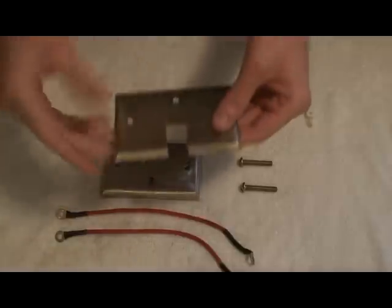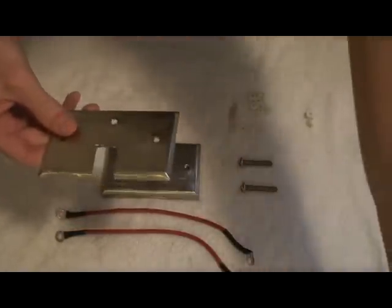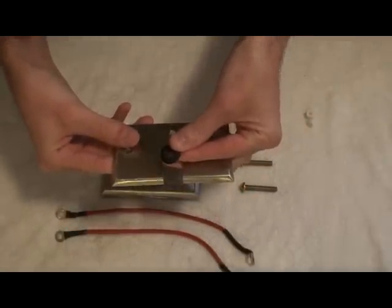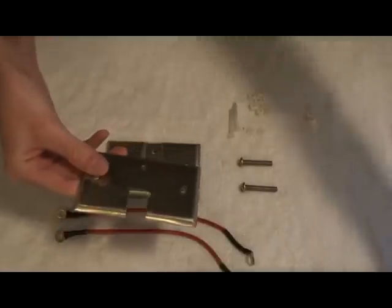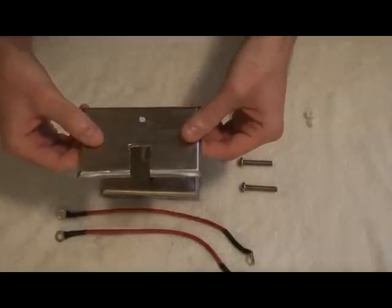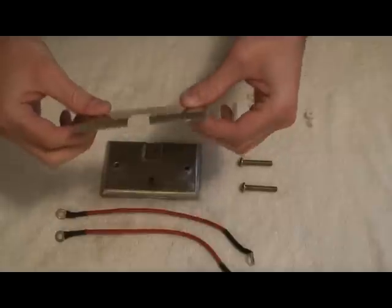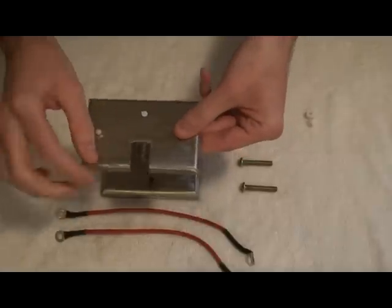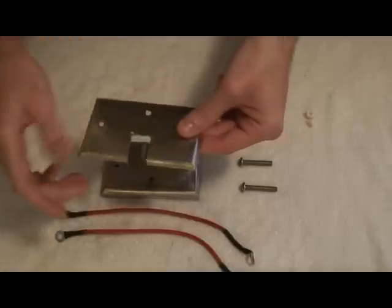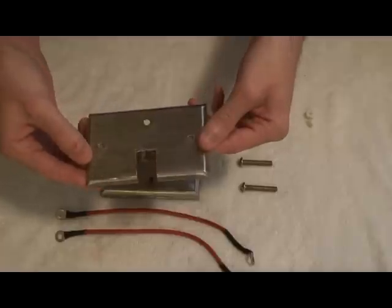As you might have noticed in some of my previous designs, I had a bigger hole with just a rubber grommet protecting the screw from coming through and shorting it out. While I was testing it, I noticed that the rubber grommets were actually preventing the spacing of the cells between each other. I wanted them a little bit closer and I could not do it with those, so I decided to cut little sections off everywhere there was a grommet to get rid of the grommet and make sure things weren't going to touch one another.